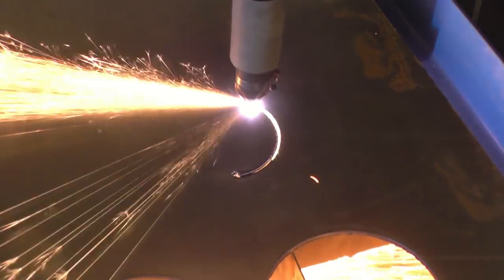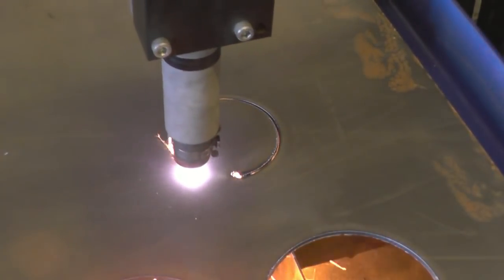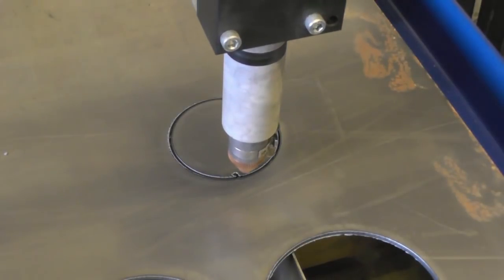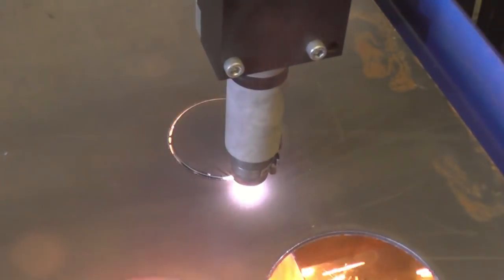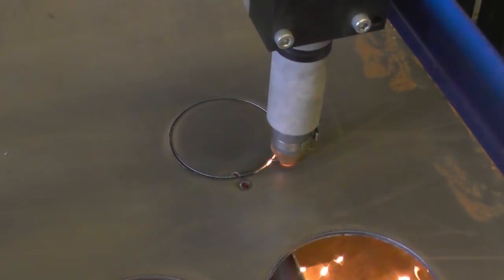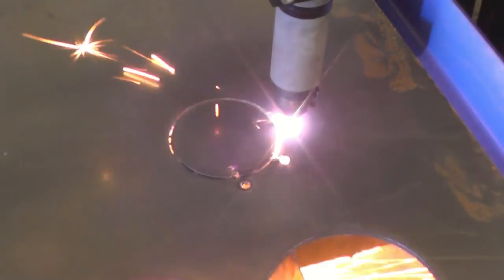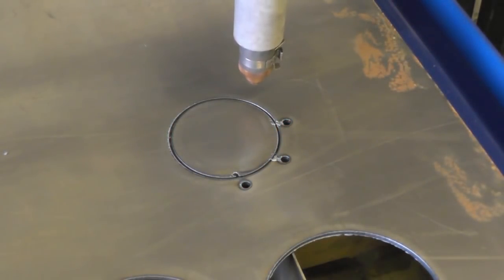This has actually been cut out of two millimetre material — it doesn't need to be that thick, it just happens that's all I've got. I'll probably do this again, possibly out of aluminium or some thin stainless. I've set the machine to cut these holes at five mil because I want to put a six mil drill through them for a six mil bolt to pass through. When I get a good look at it, it's done quite a nice job — it's a much neater hole than I would have expected.